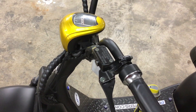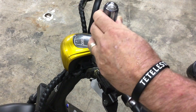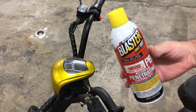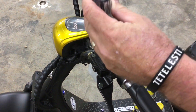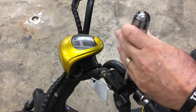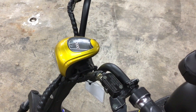Another trick when you want to take off a Phillips head screw: prior to doing so, take a hammer and tap on the top of the Phillips head on both sides a couple of times. That's going to help loosen it. Spray a little penetrating oil on each of the heads — you don't need to spray a lot. You can repeat the tapping process several times because what you're trying to do is jar the threads loose, as they may have solidified over time.